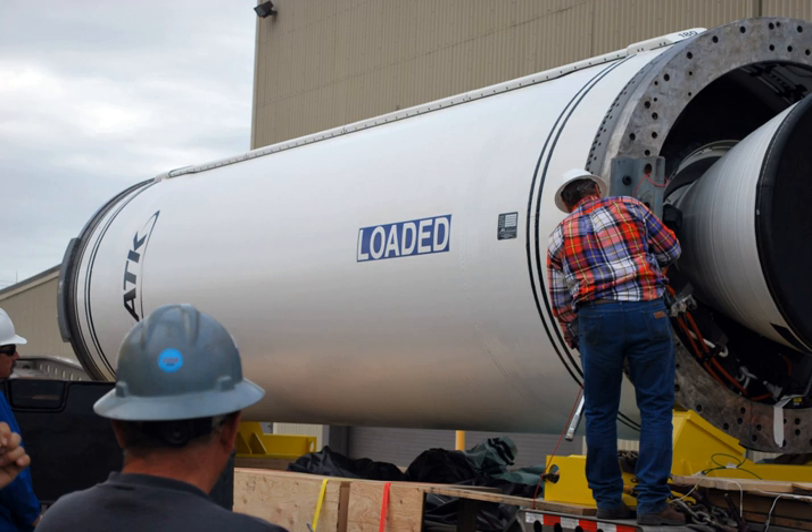Castor-30: The Castor-30 motor is based on the Castor-120 motor, which has flown on the Taurus I, Athena I, and Athena II launch vehicles. The inaugural flight of the new motor occurred in April 2013 as the second stage on the Orbital Sciences Antares medium-lift rocket for International Space Station resupply missions. The Castor-30 upper stage measures 138 inches in length and 92 inches in diameter, and weighs 30,000 lb. The motor is nominally designed as an upper stage that can function as a second or third stage as well, depending on the vehicle configuration.